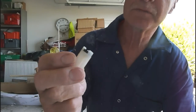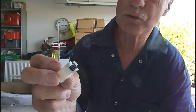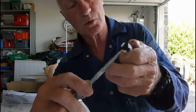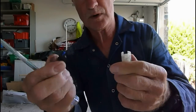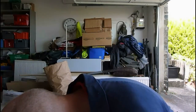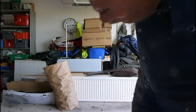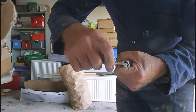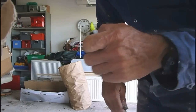In there we have our washer, which can be renewed very cheaply from the plumber's merchants — next to nothing. Get a new washer and slot it in. You need to get a screwdriver under the washer to pop it out. Once it's out — it's a little bit tricky getting a new one in because it can be a bit irregular — just slide the new one in and force it into the slot. Push it in and it goes back in fairly easily. Make sure there are no blemishes on it and it's seated right in there.